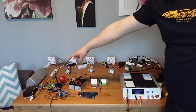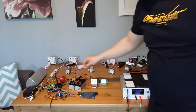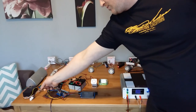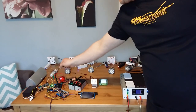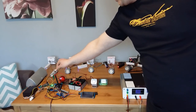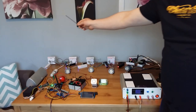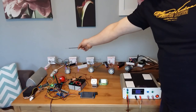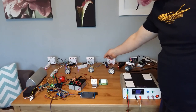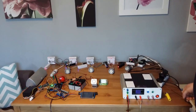And then the three relays on the back are 12 volts, so they are powered straight from the battery. Then another 5 volts goes to the card reader, and 12 volts go straight to the MP3 reader plus the amplifier for the speaker. Then I have everything wireless, all the modules: kitchen module, living room module, bedroom module, children's bedroom module and bathroom module. And now you can see I also attached lights over here.